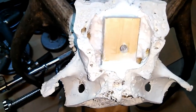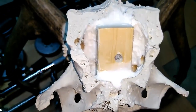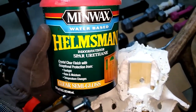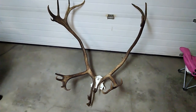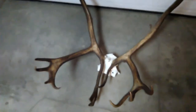I used some kitchen and bath silicone to hold that 2x2 block in place. Now that the silicone is cured, I'm going to put some spar urethane on — I put a couple of coats of this on all the painted surfaces to make it a little more waterproof.